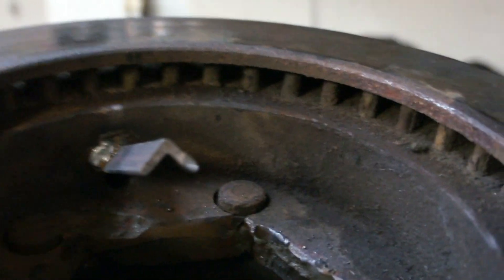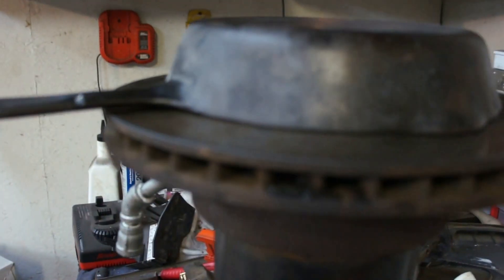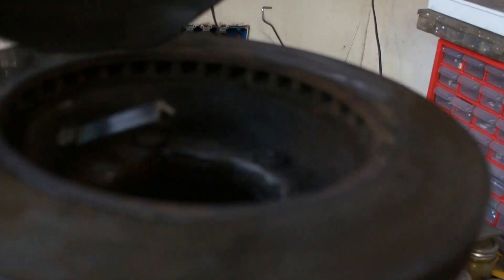I cut the center out — it's not cut out real pretty but it'll work. I punched it through and used a piece of angle iron to carry my drip out further into the center. You can see there's the hole, and the angle iron carries it out so it drips into the center of the pan. I've got a couple of cast iron fry pans — I found that a lot of the new ones have an arch in the handle, so you won't get a seal. This is an older one where the handle is perfectly flat, covering the circumference nicely to complete the burn chamber.